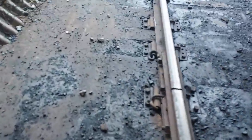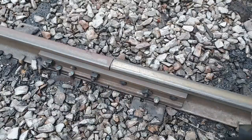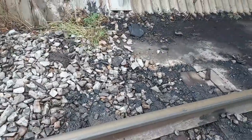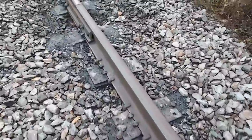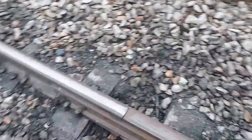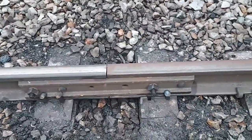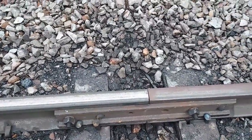Tuesday I got another guy to come out and help me make that little repair. Then we had a couple of guys from Frontier Railroad come out and help. What we did was add rail over here — we pulled the spikes, knocked the anchors, and shoved a piece of rail down against that joint. Then we cut out a piece and put a plug in. We actually added probably two and a half inches of rail in here, which it really needed. We've got the back two holes drilled, and this is going to be a welded joint as soon as we can get a welder out here.